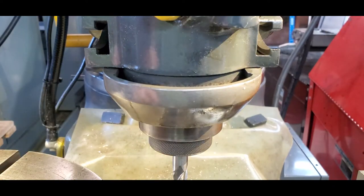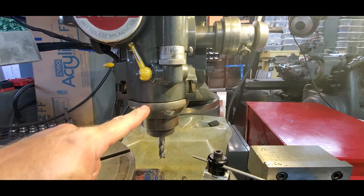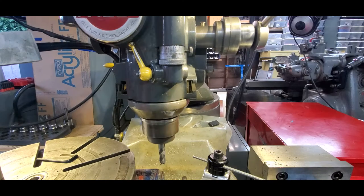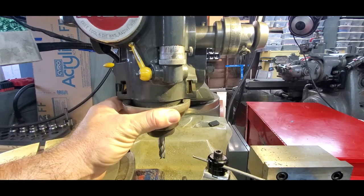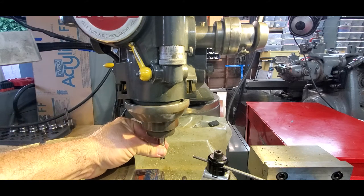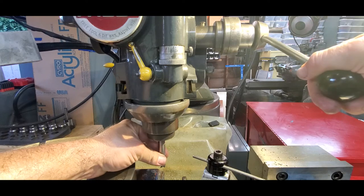Close the collet, close the yoke — ready to go. Here's the action with the handle in play. Notice the yoke is closed. Now the quill will descend. But if you jiggle the handle a little bit, you can open the yoke — it opens just a little bit, I'd say three quarters of an inch. Once that's open, hold your tool and pull the handle down — I'll move the handle so you can see. Pull the handle down, that opens the collet, your tool comes out.